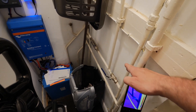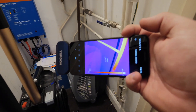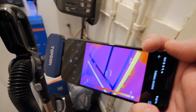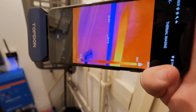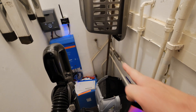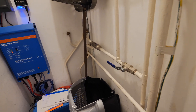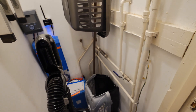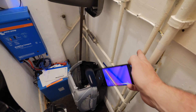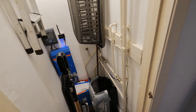With the shower running I can now feel which pipe is hot and which is cold with my fingers. But looking at the cold pipe through the camera, you can see it's darker blue going across there, while the one going up to the ceiling is a much lighter blue — which means the water is coming in from that direction, flowing up to this pipe. So you can see which way your water is flowing. You can also use this for things like valves that aren't opening, or a mixer valve not working properly — you can see a difference in temperatures even when it feels the same to your hand. It's a great little tool for diagnosing plumbing problems.